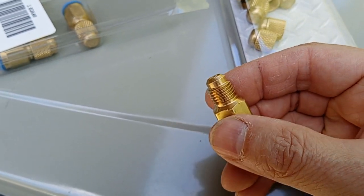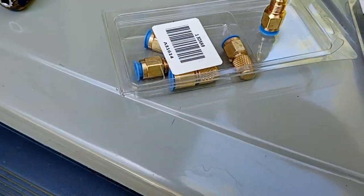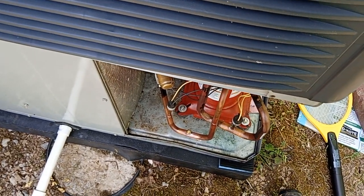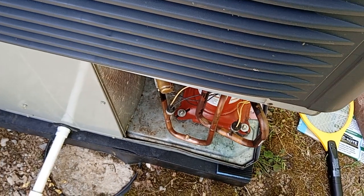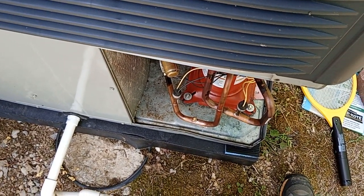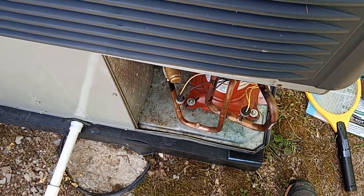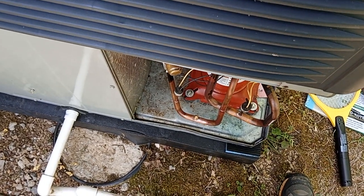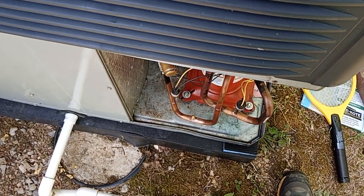So that leaves a severe problem. I can't do that. Why? Because if I take that cap off, I'm going to get a face full of refrigerant because the Schrader valve has failed. There is no way under the sun to change that Schrader valve core without dumping, wasting the system pressure, and I don't want to lose about half the charge, or evacuating the system, which I don't have a recovery system, and I'm not going to pay somebody $150 to come out and do it.